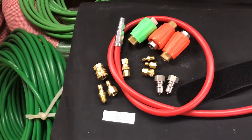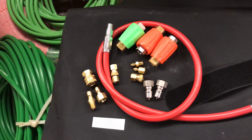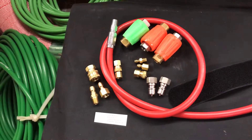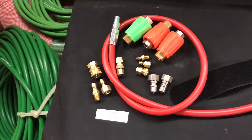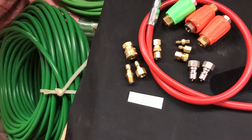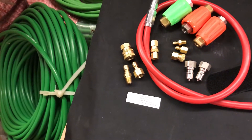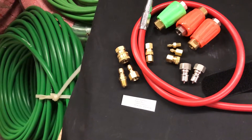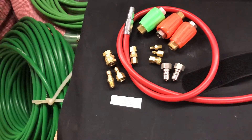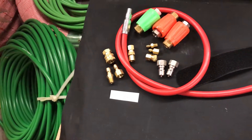The male QD can come with either male threads or female threads. All the VT wands use male thread, but a lot of you guys are buying them for your multi-sprayers and such — those use female threads. On the eighth-inch and quarter-inch flow-through, those are mainly for injection sprayers and they normally use female thread too. So your sprayers typically use female — but if that's confusing, just check your equipment before you place your order and be ready to tell us whether you want male or female threads.